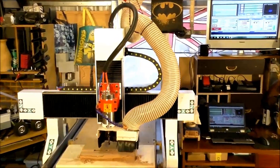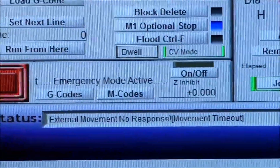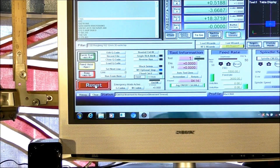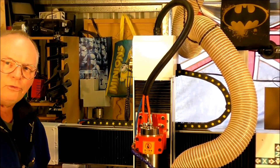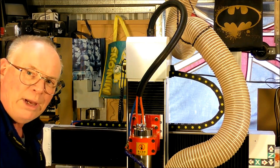What the hell has that got to do with the water pump? I'll show you — I'll take you to Mach 3 and zoom in a bit. It puts it into emergency mode, and that just shouldn't happen. Because the card inside the machine gets its power from the computer, and the computer is seeing it. So the only thing I can put it down to is that there's a fault in the pump that's leaking power through the water and back into this, causing some sort of back feed.